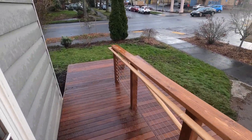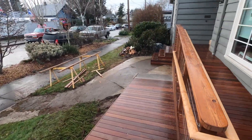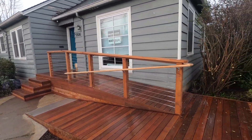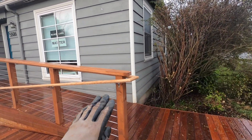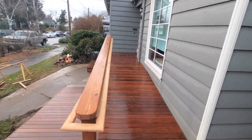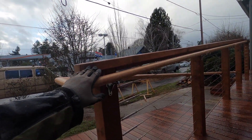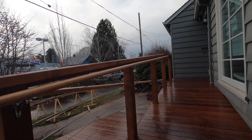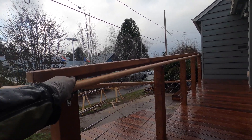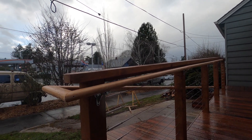It was a terrible, horrible nightmare doing this, but I got the handrail in. I'm not 100% happy with it even though it is completely functional. Coming around this corner and going up the next angle is a pretty complicated compound miter cut, and it brought the height of my rail up a lot closer to the post than I really wanted — something I didn't think about. You can grip in here, it's fine, but I think I might skill-saw this top plate back a little bit.